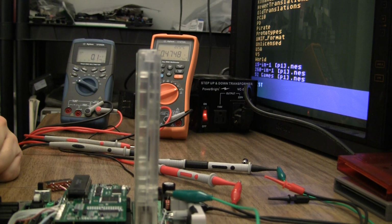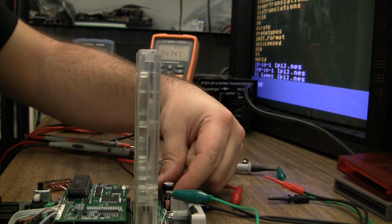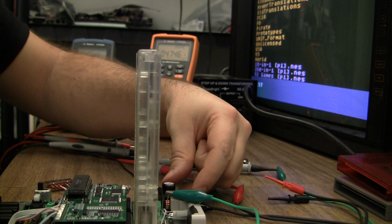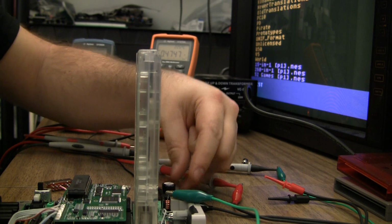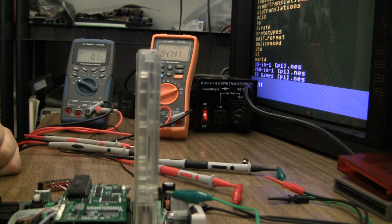One guy has posted how to add a second heatsink onto the front loader. I don't like the way it's oriented. I think he should orient it the other way. He has it wrapping around the main capacitor. Well, that's just going to heat up the capacitor. That's not what you want. If you would just flip it the other way and wrap it around the heatsink, it'd still act as another heatsink and wouldn't heat the cap. That's the only thing I'm really worried about.